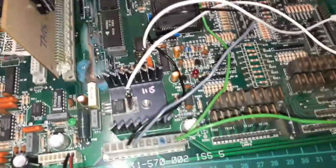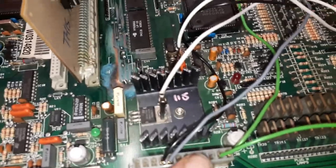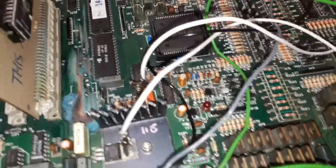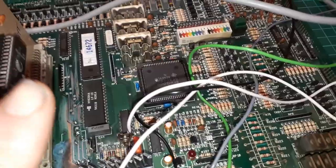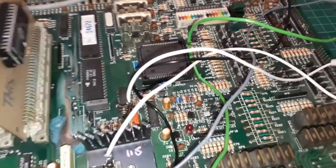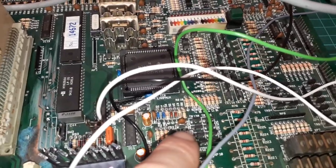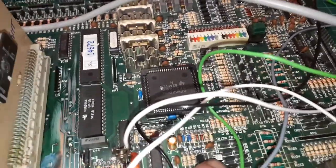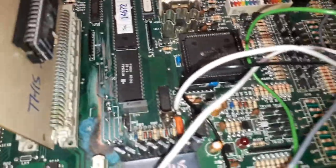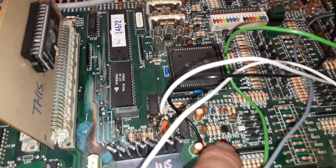So, what's wrong with it? First of all, that link wire there. When you're testing these outside the machine, or anytime at all, you might not just have a board problem. You might have a power supply problem. The line that comes off the power supply, called the VMM line, gives a rippling signal that comes into that transistor there. That's called the VMM transistor, and if it isn't getting a pulsing signal, it holds the reset off, it stops the board from working.